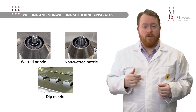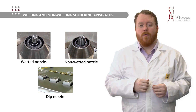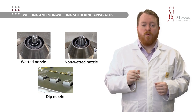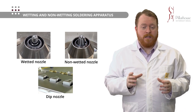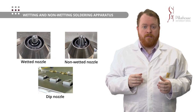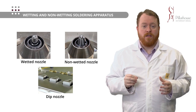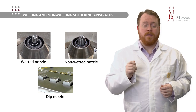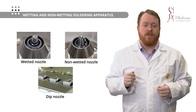In this case the surface tension is actually so high you could take something like a screwdriver and push the stream of solder around the circumference of the nozzle, which is very bad for controlled soldering. Below we can see one of the non-wetting apparatus — it has a specific cutout shape formed of titanium, and these cavities are filled up with solder which then moves up to an array of pins in a single dip process. This is great for very high volume PCBs but doesn't take advantage of the flexibility of a wetted nozzle.